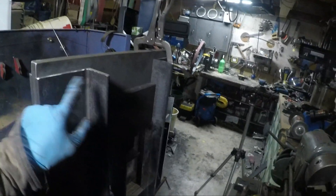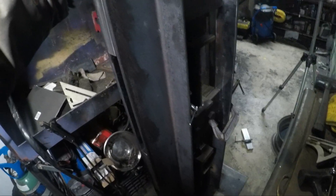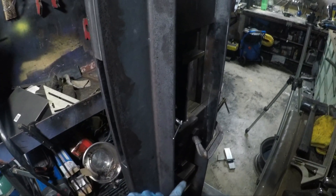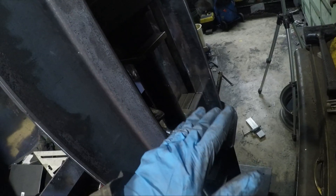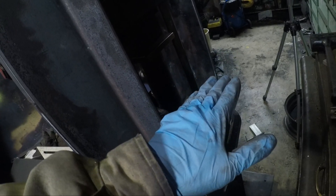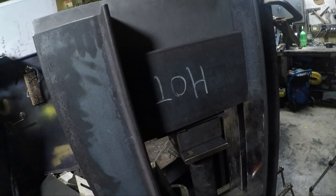I've been working on this all day. As you can see, I now have all four of the beams tack welded to the base plate. I've definitely been taking a lot of time to ensure the parallelism all the way up — I don't want there to be any racking at all when pressure is applied and it's pushed side to side. It's late right now, so I'm going to sleep and tomorrow after work I'm going to start welding this up.